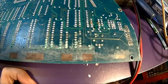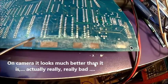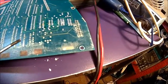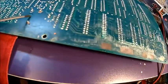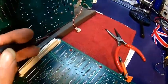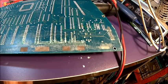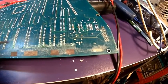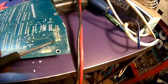Let's take that board out and have a closer look. I think we found something — there's a lot of corrosion here. There is an awful lot of corrosion between the pins all over here, so this is most likely conductive. It looks like water damage. I need to check the other boards because the battery is here and I wonder how it can creep over there. I think it's probably water damage or moisture. We'll give that a good scrub to get rid of all the corrosion, because this is certainly conductive and that may explain why it's going wild.